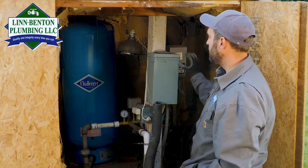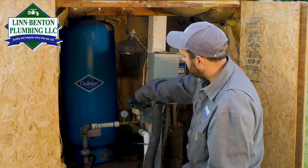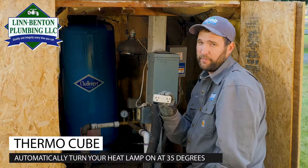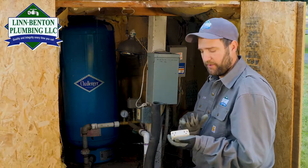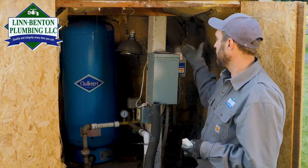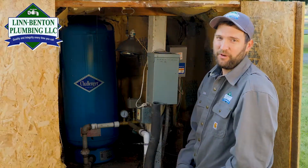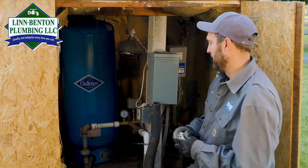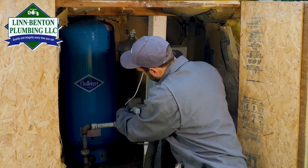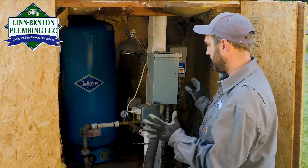I place this light strategically so it's shining on the plumbing components, putting heat where it's needed. Another feature in this pump house is this little block called a thermo cube. You can buy these on Amazon for about $11. What this cube does is turn on at 35 degrees and complete the circuit, turning your lamp on and off as needed when the temperature gets below 35 degrees. So you don't have to wake up in the middle of the night to turn on your light when it gets below freezing — for $11, done. That was a great invention.